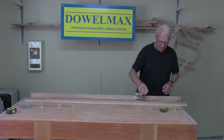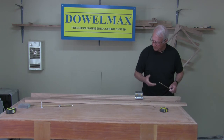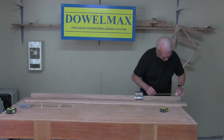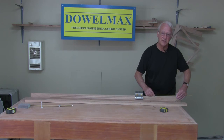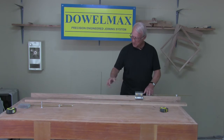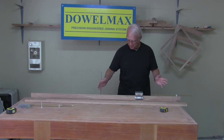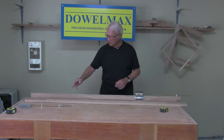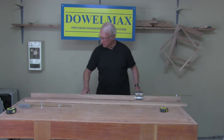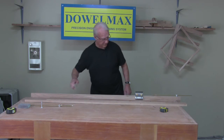Now we come down. Now we'll set the extended distance gauge. If you've only got one, you'll have to change the setting. I've got 2, so this one is set at 10 and 11/16. We've got 3 shelves that are approximately 10.5 inches in width, or the space, and 2 at 12.5. So this is space here, here, here. This is 12.5, and this is 12.5. This bottom one does form part of the shelf.